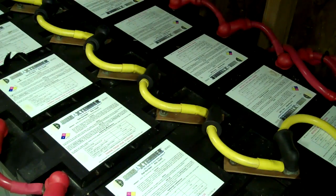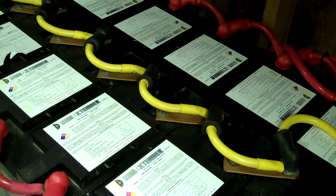For equalizing — it seems like a brutal process but it's very, very important, especially if you have multiple battery banks. If you only have one battery you don't really have to equalize, but for a large bank it's very important. On lead acid batteries you want to take them to at least 15.5 volts for an hour, and you can expect a lot of gassing, so you want to ventilate. For AGMs, I've heard different things about whether to do it — I only equalize them for about a half hour and just turn up my charge parameters a little bit.